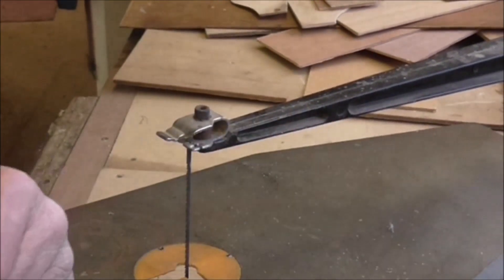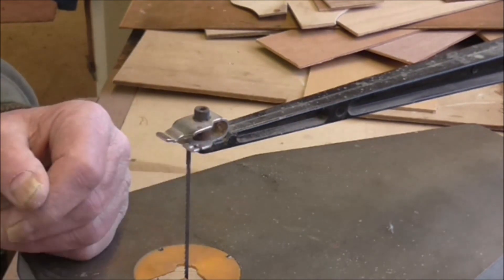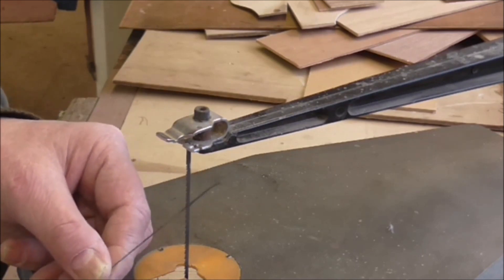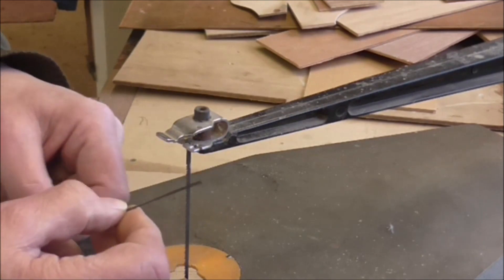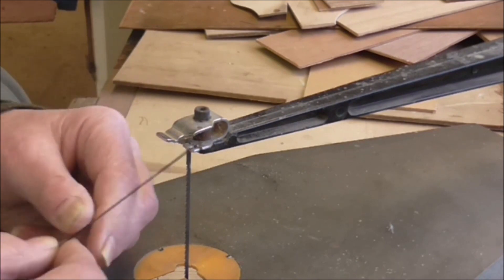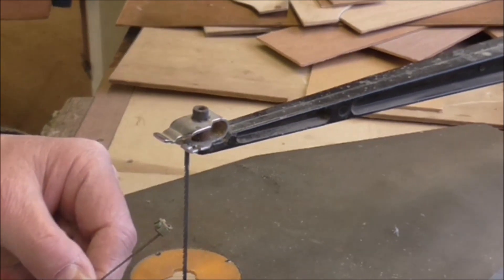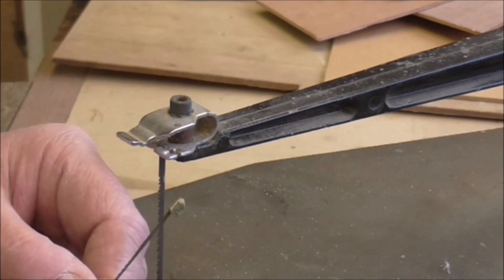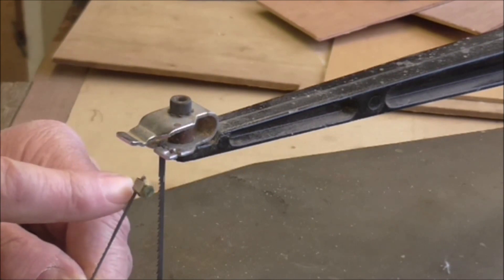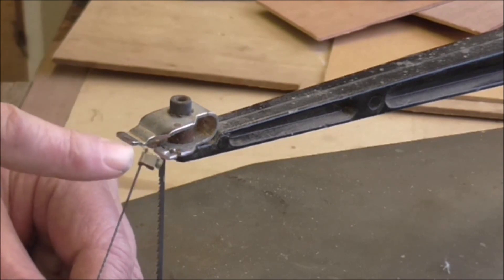Now there is a way around it — you could get some blade adapters that fit in here, so instead of using pin-end blades you could use normal fretsaw blades which do not have a pin end, and that would solve that particular problem. You can buy little adapters to use with this to adapt it to a normal fretsaw blade. In fact my old mate who gave me this saw didn't want to buy adapters, so he made his own. He got a piece of an old electrical terminal block, cut it in half — it's got a screw in it — and he just screws that onto the blade. So a normal fretsaw blade will work in a pin-end saw by using those.